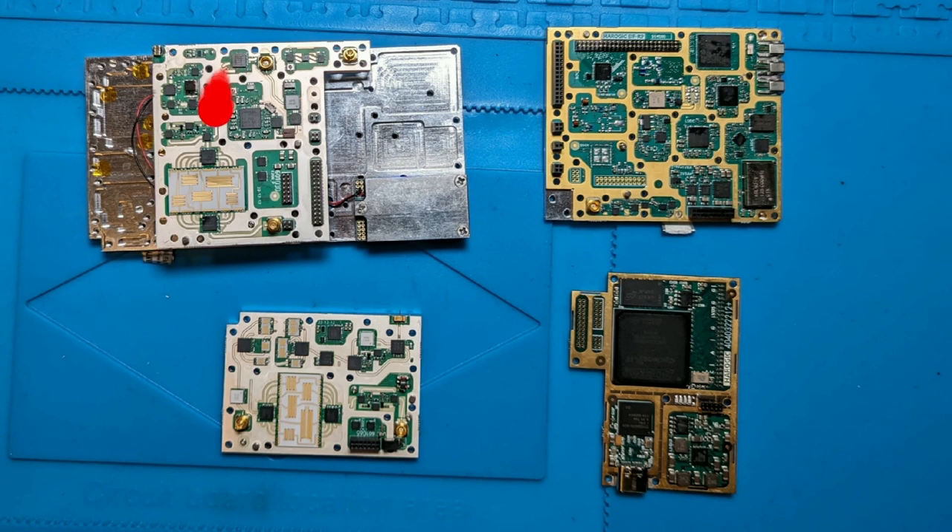On the big picture, you can see the RF front end and RF antenna. The signal goes through all the switches and filters to reject spurs and unwanted harmonics. The two cards connected together handle filtering and down-conversion to IF. Then the signal goes through an ADC that converts the analog signal to digital, so the FPGA can process it and forward samples to the computer via USB. The device is well isolated and compact — separating the parts provides proper isolation.